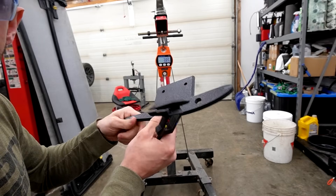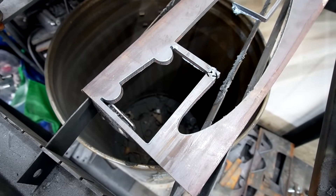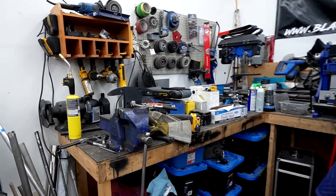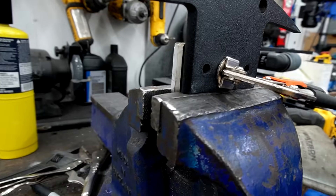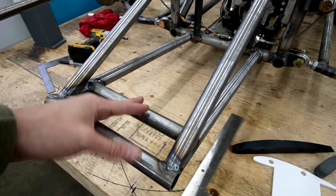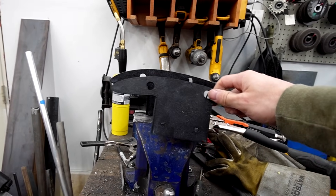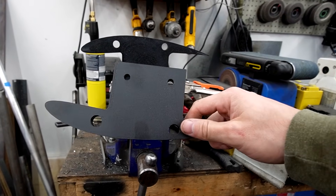This one is actually glass-filled ABS - I just find it prints so much easier and nicer. Cut out two pieces of plate on the Arc Droid, they're over here on the bench. I'm going to clean them up, transfer over the airfoil hang-down profile into these two pieces, and those two pieces get welded on right here. Then we'll drill those out, weld those pieces on, and the airfoil piece can hang down so we can put our rods through it and then put our wing pieces through it.